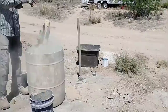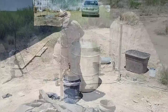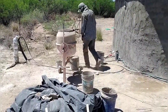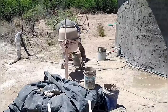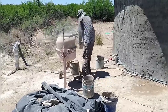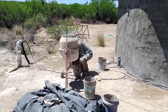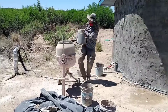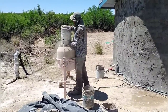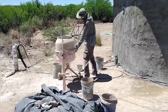We've been dumping the older cement we're using into a barrel so we could use the tamper to break up the chunks before using it in the mix. There are a lot of different ways you could mix materials like this — we've chosen to measure into five-gallon buckets and dump those in. You could do it with a shovel by the shovel full, but we like using the five-gallon buckets because we get consistent results with that consistent measurement. The five-gallon buckets are pretty heavy but they're manageable.